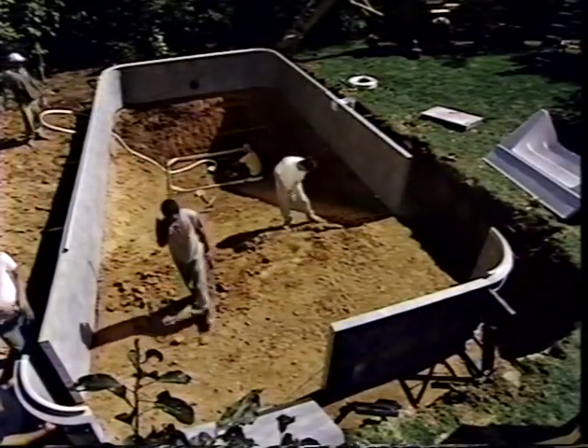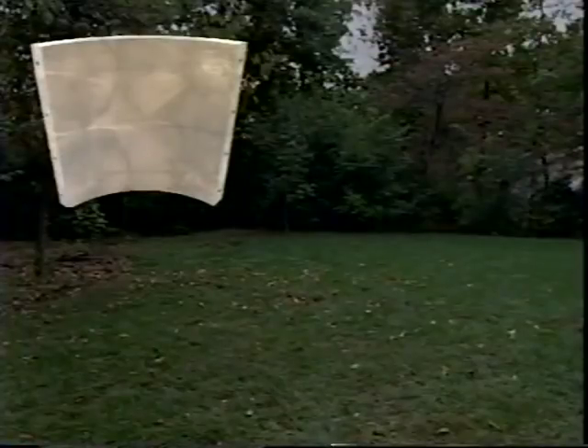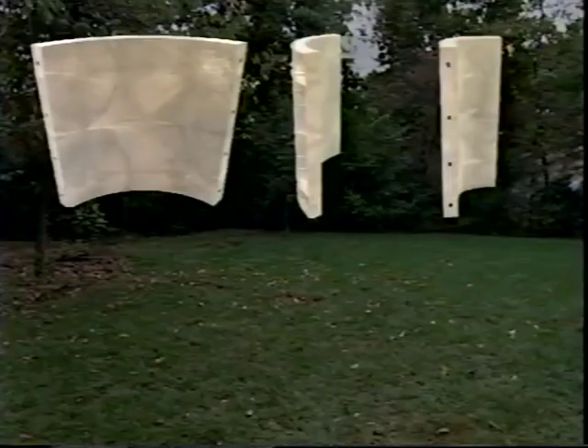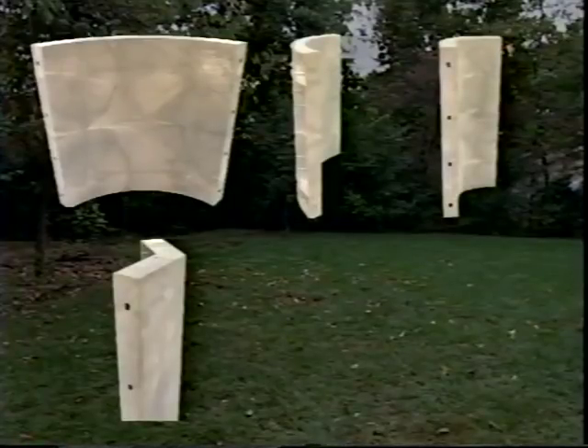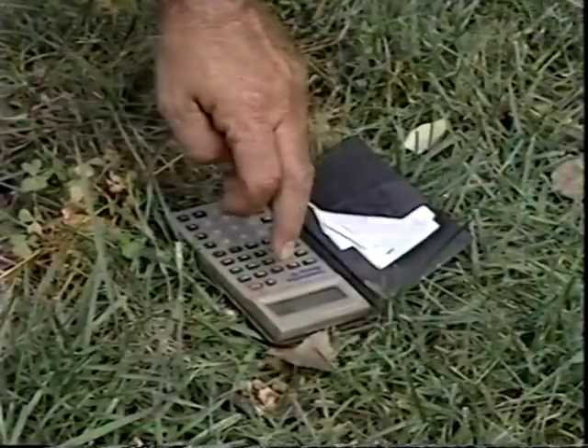In addition to the four-foot radius corner panels used in this installation, there are several other types of corners available in various pool designs, including two-foot and six-inch radius corners, 45-degree corners, reverse radius corners, and even custom angles if required. With the shallow end and panel shelf level completed, more measurements are made to determine the actual location of the pool.